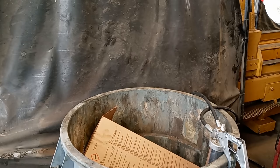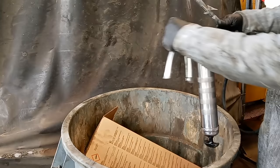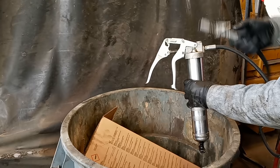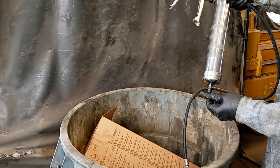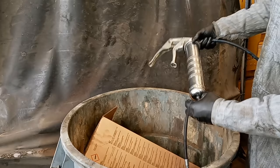I'm using this CAT branded pistol grip grease gun here. I have the extra hose that's twice as long, and I have the lock and lube — just a couple of things that make greasing a lot easier. Over the years I've had real problems with getting airlocks in my grease cartridge; it's a real pain. Now you can see the grease cartridge is almost empty — there's probably half an inch of travel, which means there's only about half an inch of grease left. So now is a perfect time to change it. You do not want to run it out.